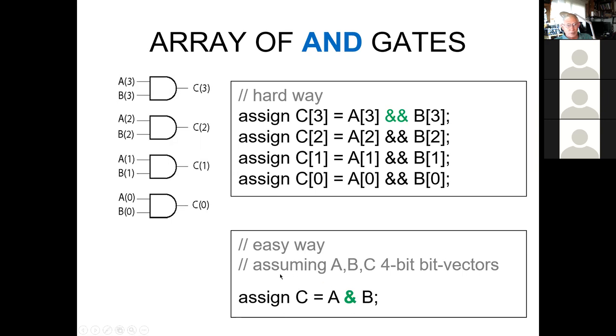When these statements appear in a process block — we have an initial block and an always block — we primarily use initial blocks for simulation purposes. However, with an FPGA, because you program it with a bit file, you can also use initial blocks in your actual code and they will synthesize. But if you're making an integrated circuit you can't do that, because the chip powers up in whatever condition it wants to.